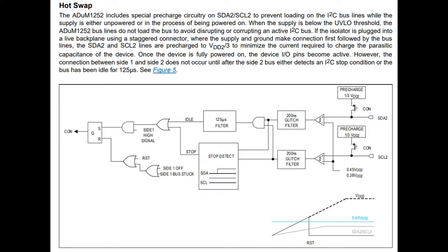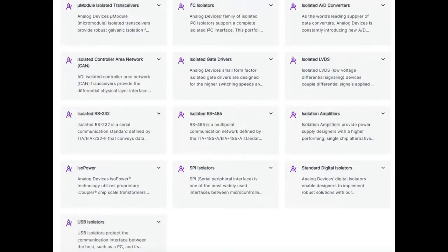There's also an under-voltage lockout. You can use either side as a level-shifting I2C converter — 1.8 to 5.5 volts. Either side can be 1.8 to 5V and you can shift up or down. In addition, if you go below 1.8V there's a lockout, so an under-voltage condition won't accidentally affect the signal on the opposite side of the galvanic isolator.